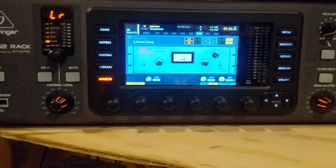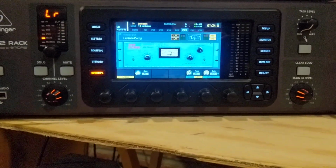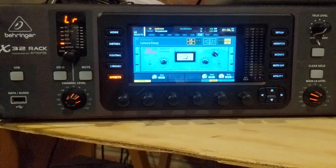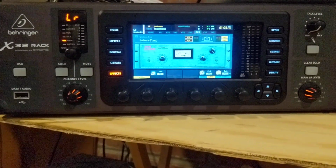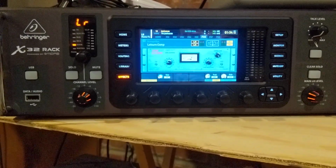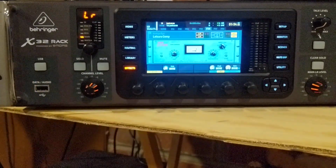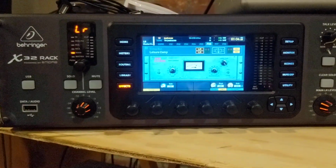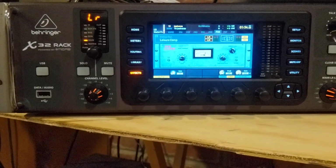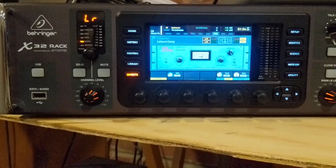Because when you're doing audio and you're broadcasting, whether you're doing a commercial or broadcasting to TV or to YouTube or wherever, you want nice clean audio. You don't want it to be where people are talking and you can't hear them, and then they start playing music and now they're really loud. So you want to try to compress that dynamic range to keep it as consistent a volume as possible for your viewers, so it doesn't get out of control.